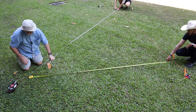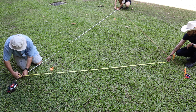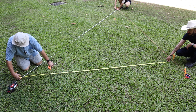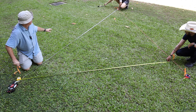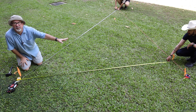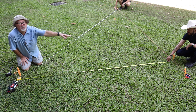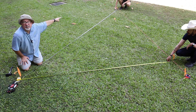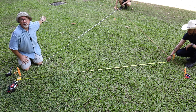Make sure both tape measures are straight and pulled tight. Where the five-meter and three-meter tapes cross — exactly where they meet — is where we put the peg into the ground. That creates a perfect right angle. Now we do the exact opposite: take the hypotenuse from that corner and three meters from Tate at the far end to find where they cross for the other back corner.